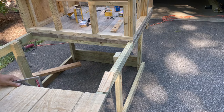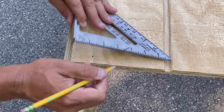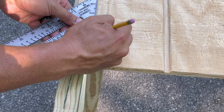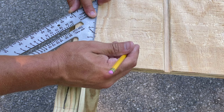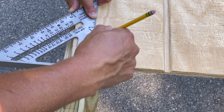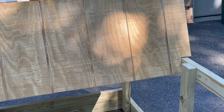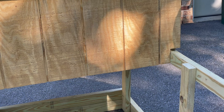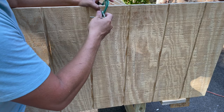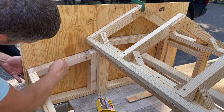What I'm about to do is one of a few miscuts I made in this build. I should have been making a notch the size of a two-by-four: one and a half inches by three and a half inches. I have no idea where my brain was - I think it ended up being four inches by one and a half inches. The end result was a half inch too big of a notch at the top, which I ended up having to put some trim over. On the other side of the coop I did take into account where the decorative grooves were falling, so it was a much better look.